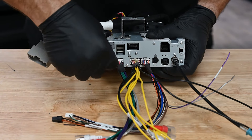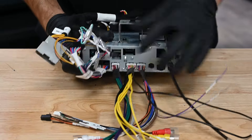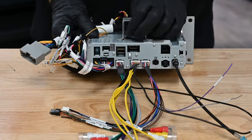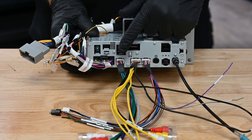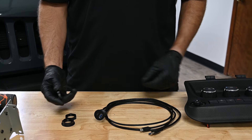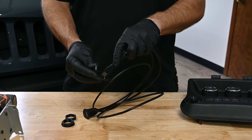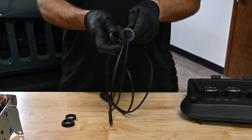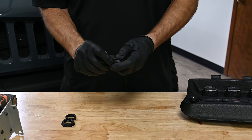Connect the large black connector into the port labeled Power. In the vehicle, we will connect the GPS antenna here. These are the USB ports where we'll connect adapters. The dash mount USB extension cable has an optional weatherproof cover. If you wish to use the weatherproof cover, pass the ends of the USB cables through the opening and pull the slack through so the cover is on the end of the connector.